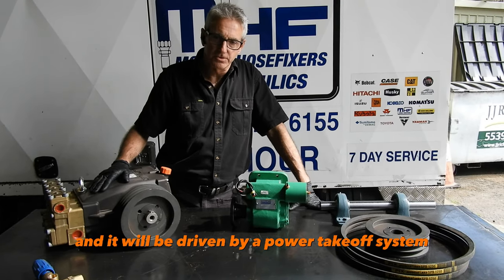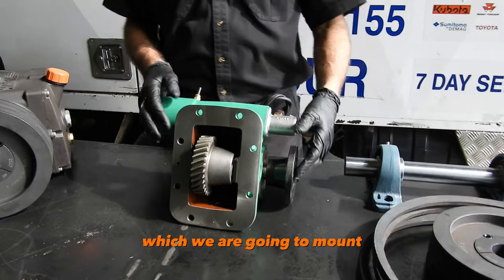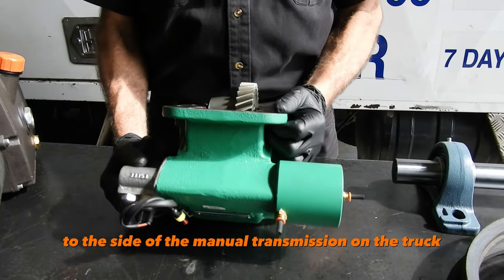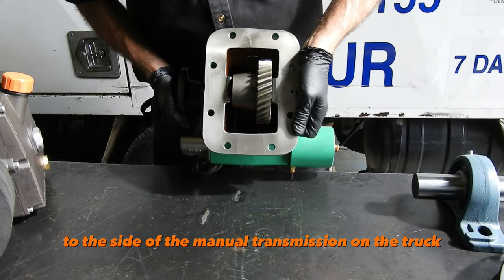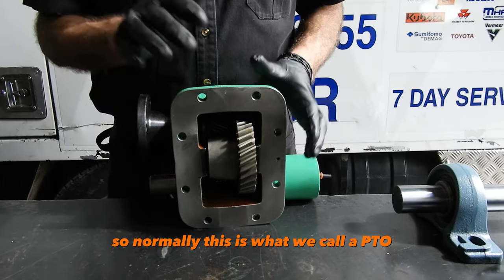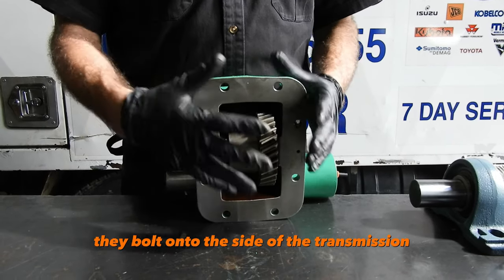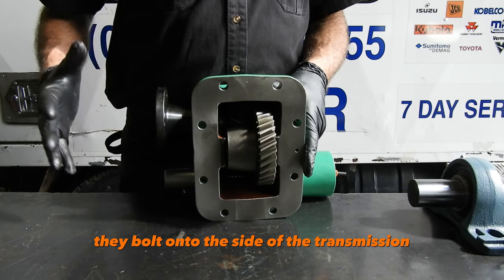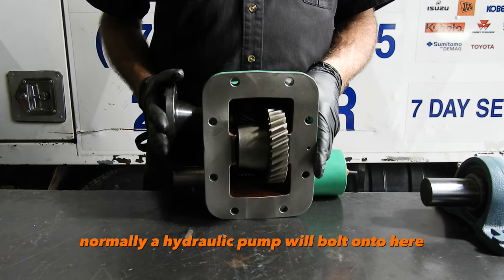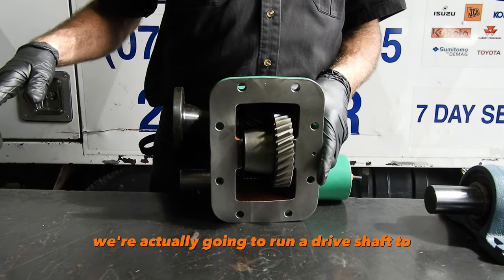power takeoff system, which is this unit here, which we are going to mount to the side of the manual transmission on the truck. So normally, these are what we call a PTO, power takeoff unit. They bolt onto the side of the transmission. Normally a hydraulic pump will bolt onto here, but in this design, we're actually going to run a drive shaft